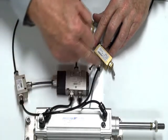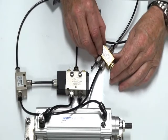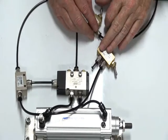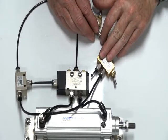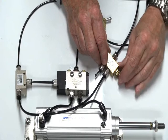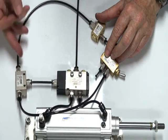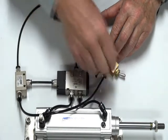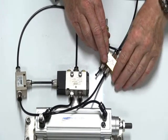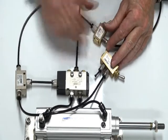Normally it would have come out through the exhaust port of the other valve, but we use this other pilot to do the same thing. If I put this one on here, nothing's going to happen because the other signal is blocking it off — it'll only accept the signal that arrives first. So when I put this one off and put the signal on, it goes through and locks this one off, and when I put this signal on it's not going to go anywhere.